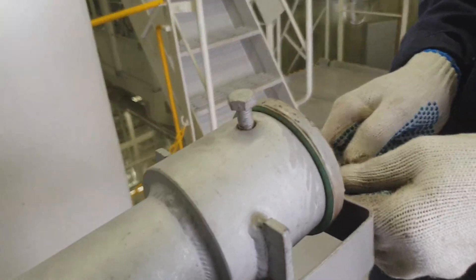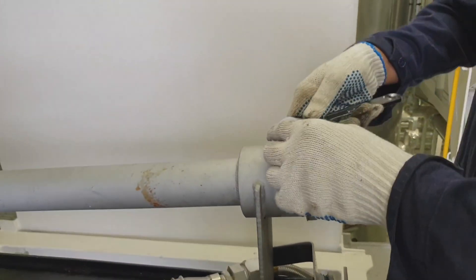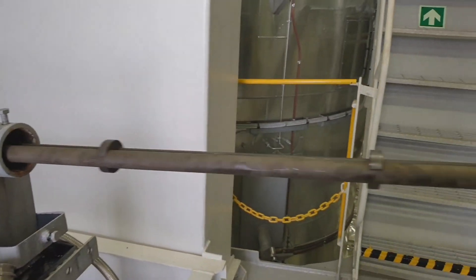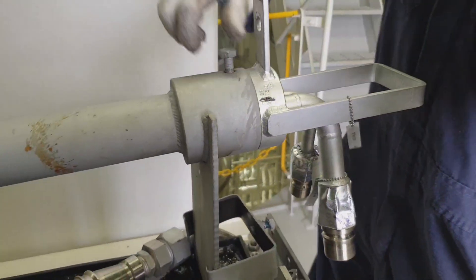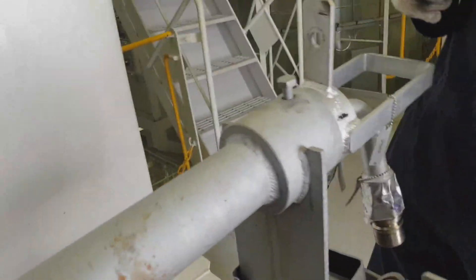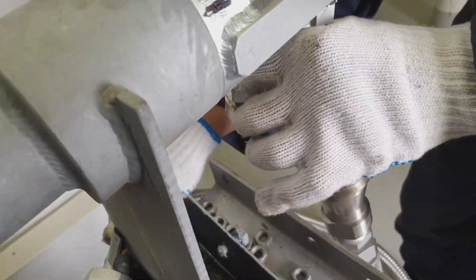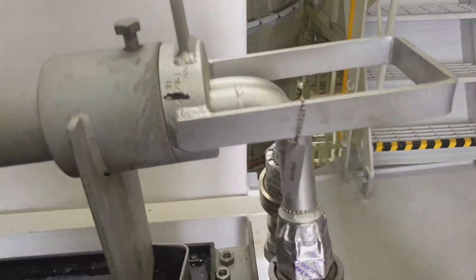This is the pipe in which the burner gun has to be inserted for cleaning — this is for cleaning using steam. Right now I am opening the cleaning pipe and inserting the burner gun so that we can clean by steam. I am inserting it into the hole and pressing the locking bolt of the burner gun to lock it first, then attaching the quick release connection. This is the steam connection, and for the fuel and steam connection, we have to connect both of them.